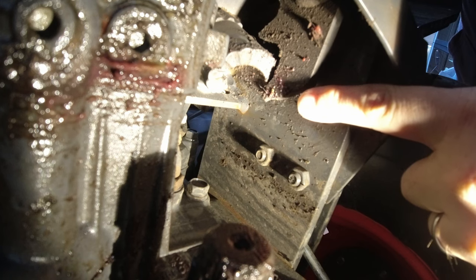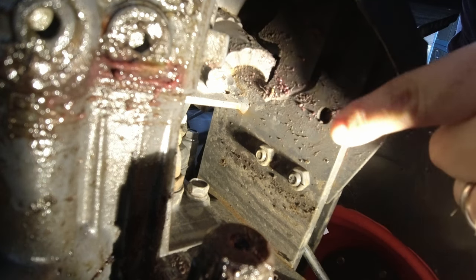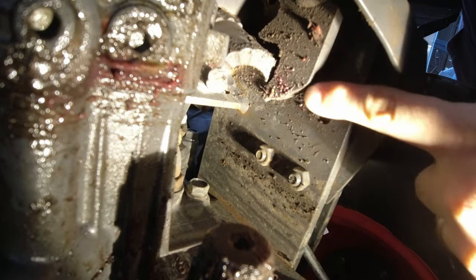What I'm gonna do is raise it up. You'll also notice there's a space and a tab — the tab is what keeps it in its top dead center, and at zero it can freely flow within that indented space. I'll start the tractor now, raise up the three-point attachments, you'll see this bar remove, and I'll be able to rotate that knob again.